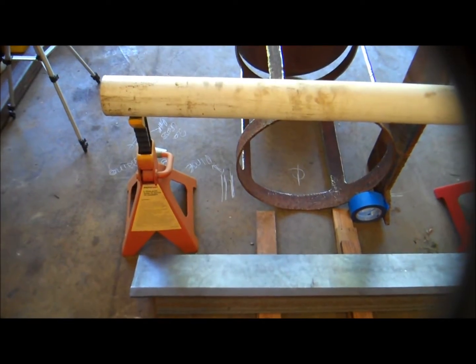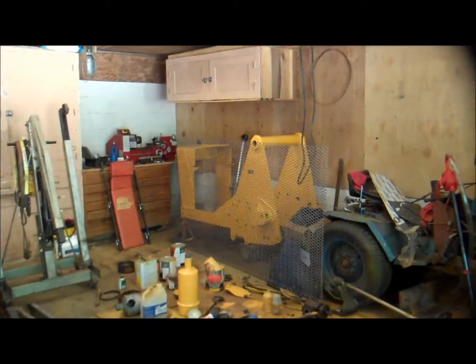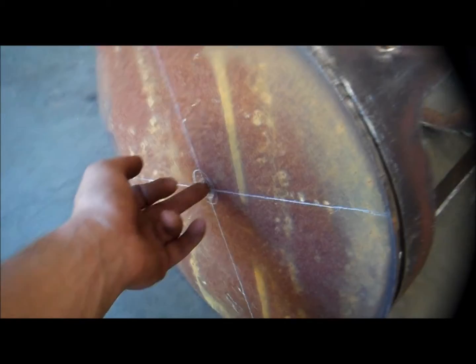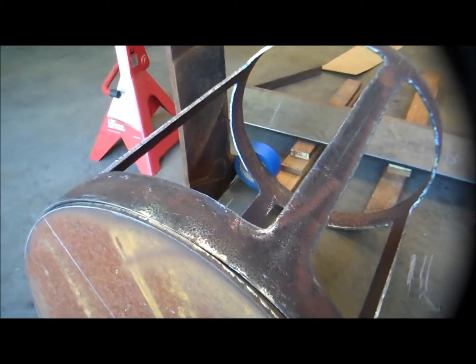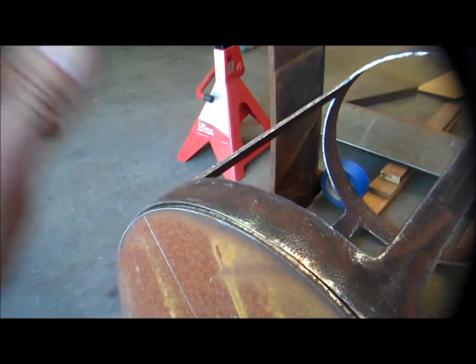So when you have the screen horizontal, it'll keep everything in the screener. I've got some expanded metal that I'm going to put in these openings. The end plate here, I'm going to put a 1-inch shaft through it with a bearing mounted there and a sprocket coming up. There'll be two cross tubes — I'll probably use this 2-inch I've got here. And I'll set a hydraulic motor right here with another sprocket so I can change the gearing.